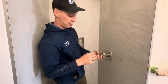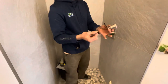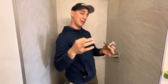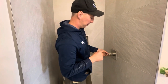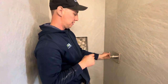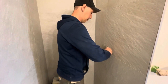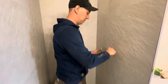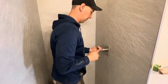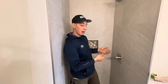Now for the handle. It comes with a set screw, and when you buy a brand new Delta valve it includes the proper allen key — I believe it's 2.5 millimeter. We know which way is hot, so we tighten the handle on with the set screw — snug, not super tight — make sure it's not coming off, and push it in so it moves freely.